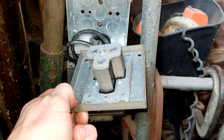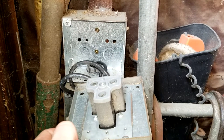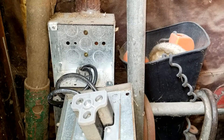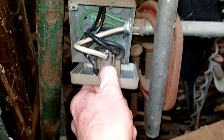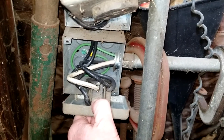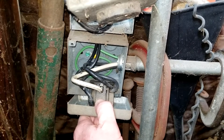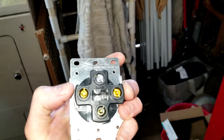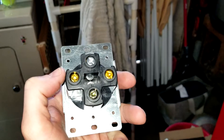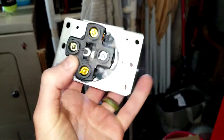I've gone ahead and pulled off both of the face plates, exposing the wires. There are only two coming up to the top one, so that's not going to work — we would have to run another wire all the way through the conduit to the breaker box. But good news is the lower one has the ground — see the green wire there. So it looks like we have four hots and a neutral white. This is great news for what I need to be doing. We're going to put the neutral white by the silver screw, two blacks one on each side, cap off two of them, and put our ground in down below.